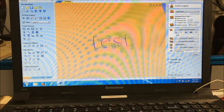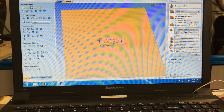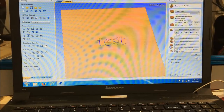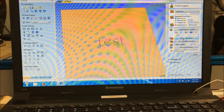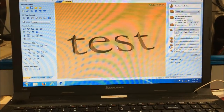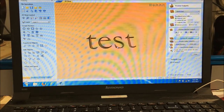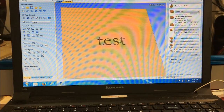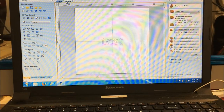Calculating it shows you basically where the bit is going to move around to carve this out. I can rotate it, zoom in and out by rotating the little thumb control on my mouse. You will want to use a mouse during this — it's hard with just a laptop and no mouse. We're going to go ahead and actually see what it looks like. This is the preview tool. We're going to preview all tool paths and click on that — it shows you basically what it's going to look like, kind of how deep it's going to go. That way you know before you go cutting anything, does it look right? Did something jump off the page? That's the wire drawing of it, or line art, and that's the 3D of it.